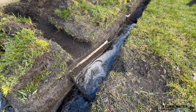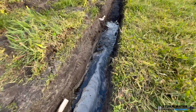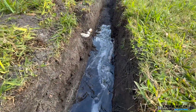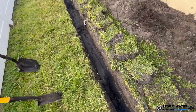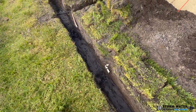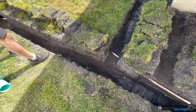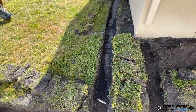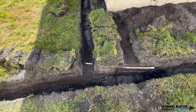The other reason we run water in the trench is that we'll run the water and then go to lunch. When we come back, we like to see how quickly did that soil absorb the water — did it turn to mud, is it completely gone, or is the water still sitting in the trench? If it's still sitting in the trench, we'll pump it out with a little utility pump.